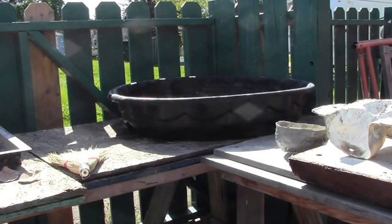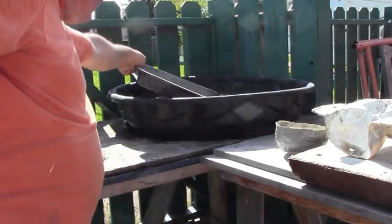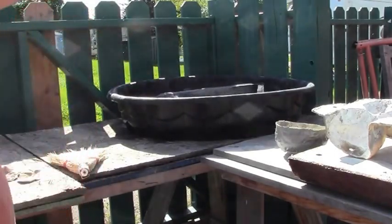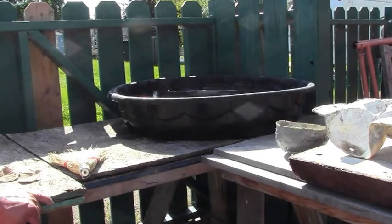What I have here is just a child's play pool — I picked it up at Canadian Tire for about 10 bucks. You just basically fill the tub and throw everything in and let it sit for a day or two. Just take your mold and in she goes. Fill it up and the acid water will start attacking the concrete. Take it out in a day or so, rinse it in water, and you've got a clean mold.